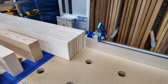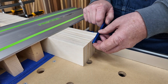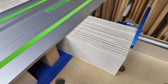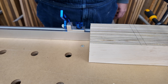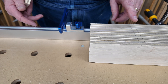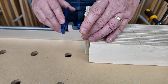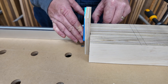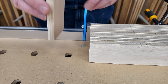The exact positioning of these trenches isn't really very important, so I'm just going to use the rough pencil lines and set a stop. The way I have it set up now, the kerf will happen inside the trench. I'd like to set another stop at the other end so I know how far I can slide the board while making multiple passes. I'm going to take a piece of the same material as a spacer and set the second stop, so that when I slide the board down to that stop I should end up with a trench the same width as that board.